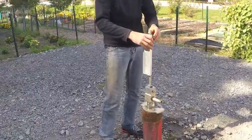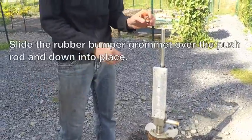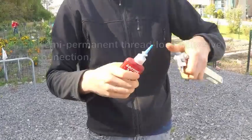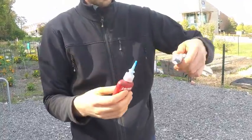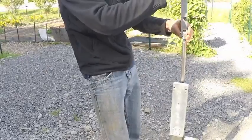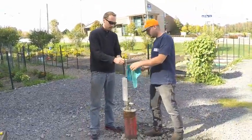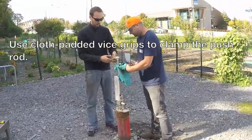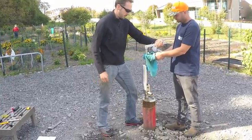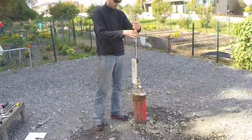Slide the back plate over the pushrod and down into place. Grab the rubber grommet — you'll absolutely want to make sure this bumper is in place over the pushrod, down into place over the linear bearing. Apply semi-permanent threadlock adhesive to the stainless-to-stainless connection on the vertical link bar on the clevis and screw it into place. Start by hand, then use cloth-padded vise grips to clamp the pushrod, and holding the vertical link bar horizontally turn clockwise to tighten it down. Use the cloth to ensure the pushrod is not scarred or marked during this process.